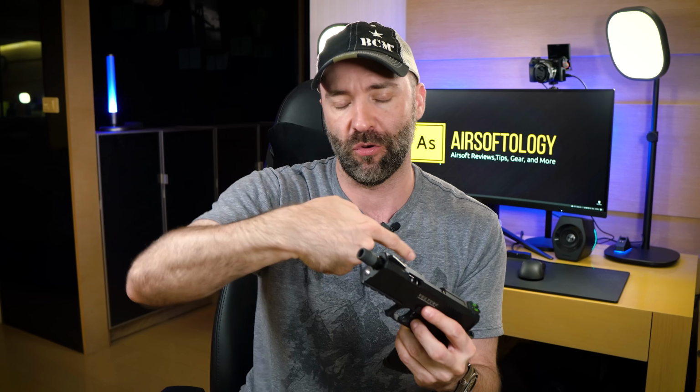However, most of this is made of an aluminum material. This is made of steel. It's a different material. You can definitely tell that. They did put some flat sides on here, so if you get it jammed in there, it gives you an area to use a wrench and not mar this thing up and actually get it off, which is nice. Because when you put it on and you put the suppressor on, you're actually going to be threading this thing on extra tight, and it could be tough to remove, either from getting stuck inside your suppressor or stuck in the barrel.